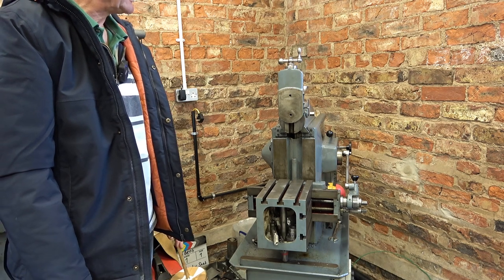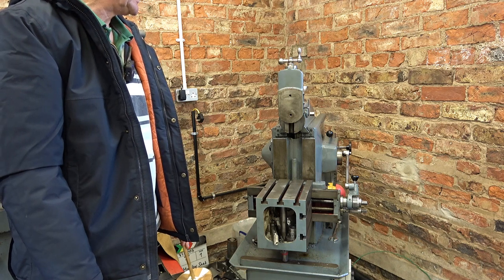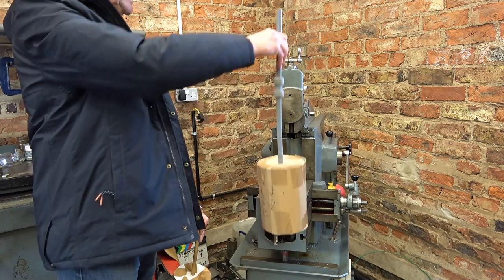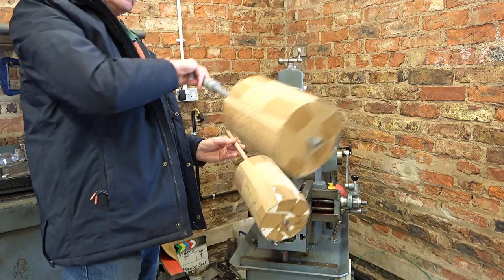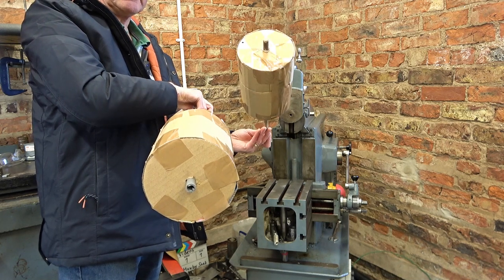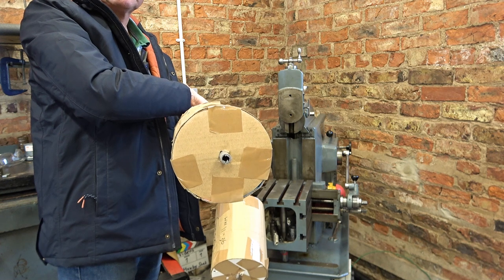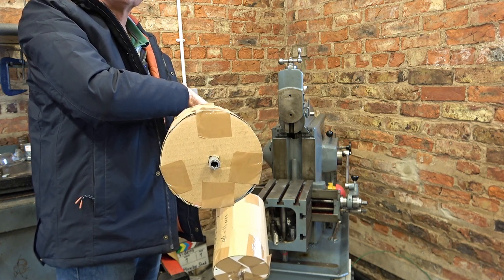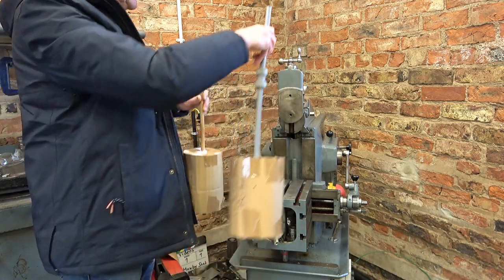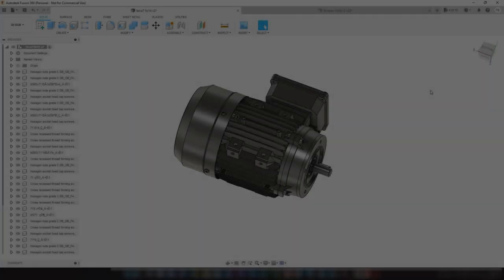When I started to think about the size of motor I needed, I had to think about both power and physical size. So I started with CAD — cardboard aided design. This is a model of a 375 watt motor and this one is a 550 watt motor, showing the two spindle sizes. It's a bit of a joke, but they are representative: the 375 watt motor had an 11 millimetre spindle and the 550 watt motor had a 14 millimetre spindle. I decided 14mm was the smallest diameter I could really work with, so although this is a bit of comedy it actually helped me decide what physical size of motor I needed.